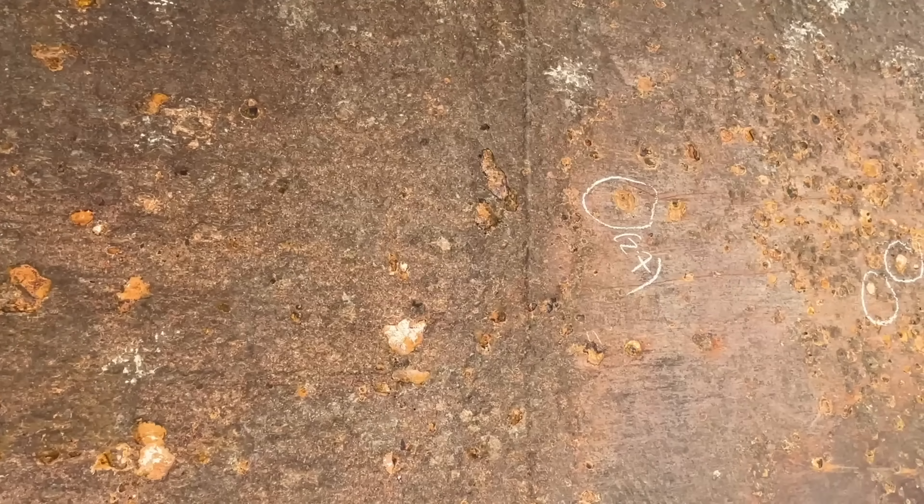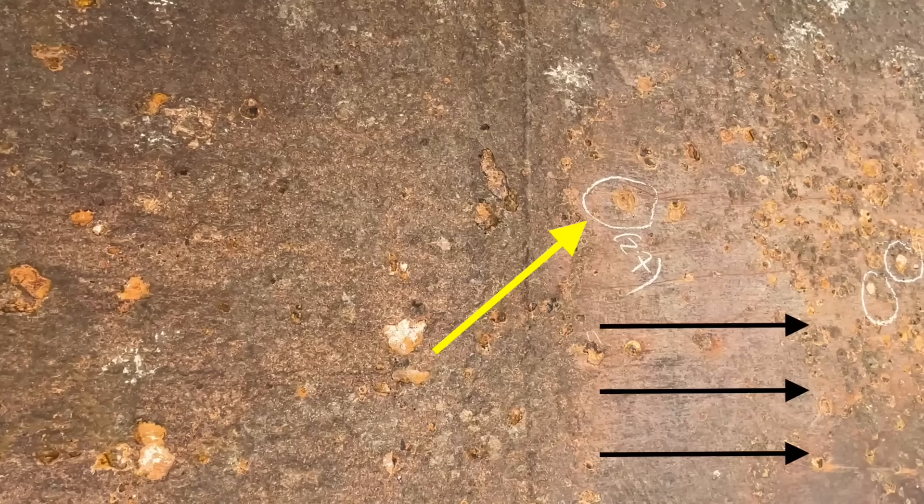Lying on the floor looking up at the bottom plate roughly midships, here is a pit of 2.7 millimetres in what is mostly a reasonably good looking plate. Note the small section scraped along something, with scratches lined up fore and aft running at 90 degrees to the plate weld. A closer look shows there's actually quite a lot more going on, with several areas of corrosion that don't all look the same — clearly more than one mechanism at work, as is often the case.